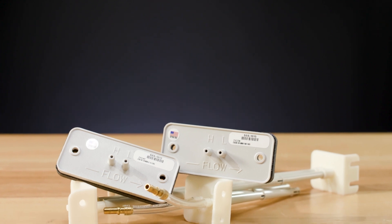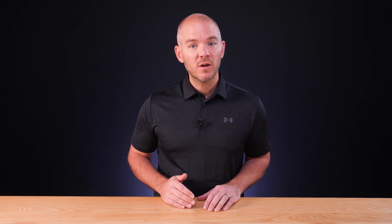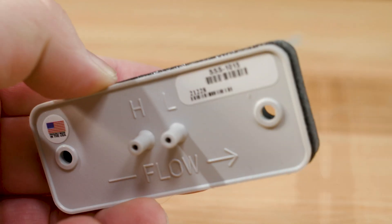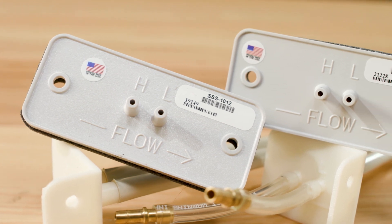After you've picked your controller, you'll need to select differential flow pitots. The pitots can be mounted in one of two locations: a place with laminar airflow, such as six straight duct widths down the supply air duct, or on the supply fan inlet. When selecting models from the SSS1000 series, it's important to select pitots that are long enough and have the correct minimum number of sensing ports for your system. Keep in mind that sensing points must be arranged evenly to cover the supply air duct.